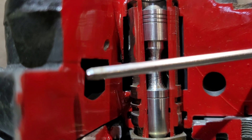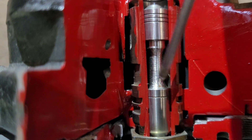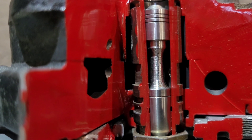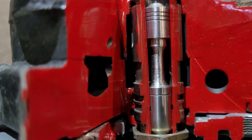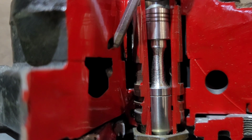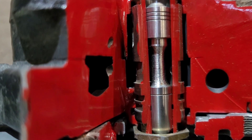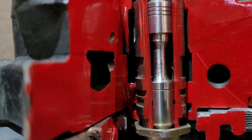We've got fuel in our lower chamber which also fills all this upper chamber, so this is all full of fuel. On the side of the fuel body is an orifice, and inside the orifice is a tiny slit — the slit is 0.2 millimetres in width, which is next to nothing. That fuel comes in, through this gap, comes out that slit and into this top orifice, goes down on top of the metal plate, pushes down and overcomes equilibrium as we learned in the last video, and then comes out the injector.